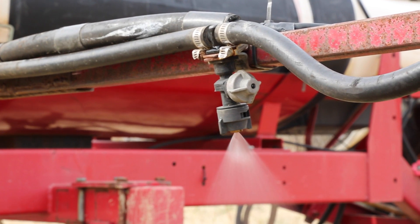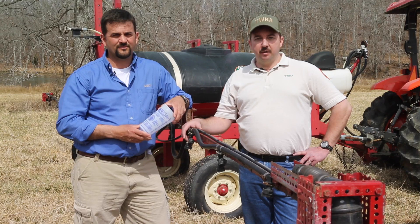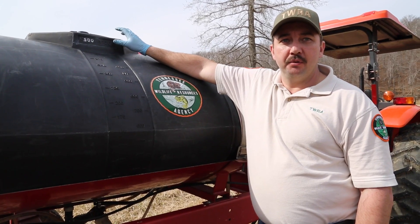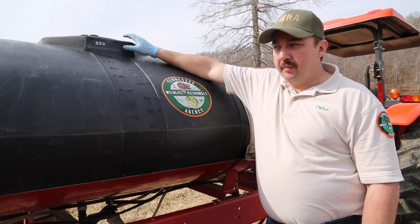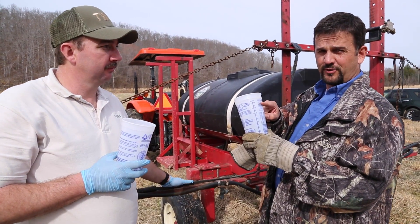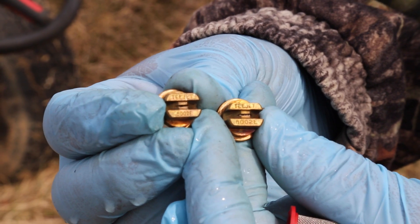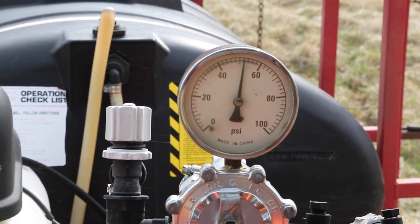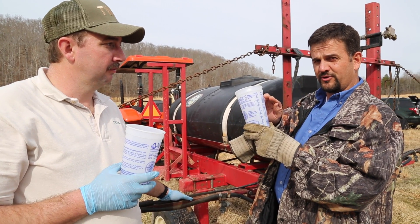One nozzle output of water in ounces equals gallons per acre, so 20 ounces of water caught during this time equals 20 gallons per acre. This is the amount of water per acre you will spray. We've determined that our output is 20 ounces of water, which equals 20 gallons per acre. With a 300 gallon spray tank, divide 300 by the 20 gallons per acre — that means you can spray 15 acres with this tank. To increase or decrease your gallons per acre, adjust your spray tip size, pressure, or speed, then run these same calculations to determine your new gallons per acre.